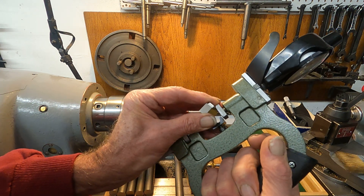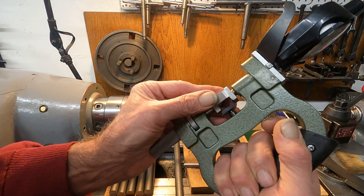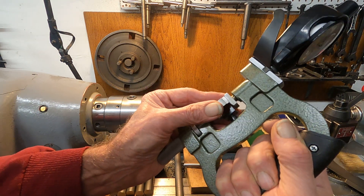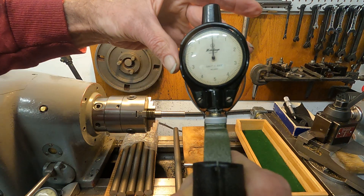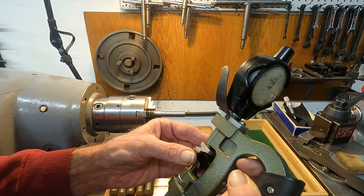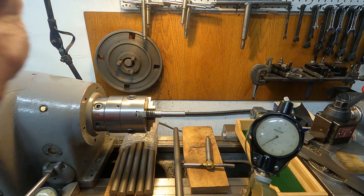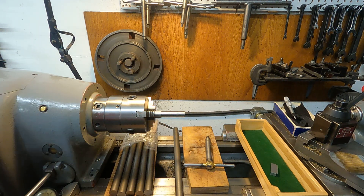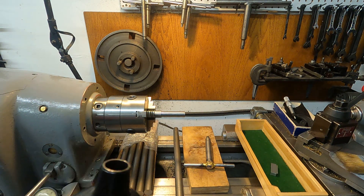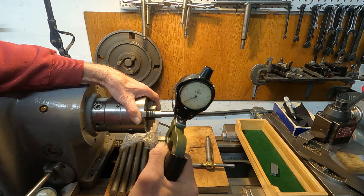I've got a half-inch gauge block with an eighth-inch gauge block wrung to it, making 0.625. I'm going to roll it into the gauge — just kind of roll that up like that — and walk the gauge block back in there, wiggle it around until it feels just right. The dial is reading right on zero, indicating exactly five-eighths of an inch within a ten-thousandth. So let's stick it on the work.